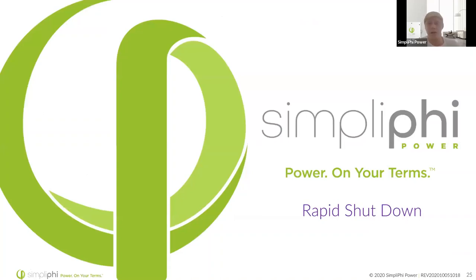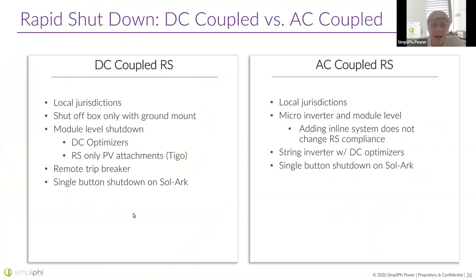There are several differences when it comes to rapid shutdown between the systems. I'm not the authority on this — your AHJ, city, or county is responsible for giving you the final word on rapid shutdown requirements as they relate to the PV array. When DC coupling, if you have a ground-mount array, you can often get away with just a shutoff box and may not need module-level shutdown, because if those panels are not on your house, a firefighter is not going to be over there swinging an axe trying to get through your roof. If the panels are not on your house, you may be able to avoid module-level shutdown, which is an added expense.